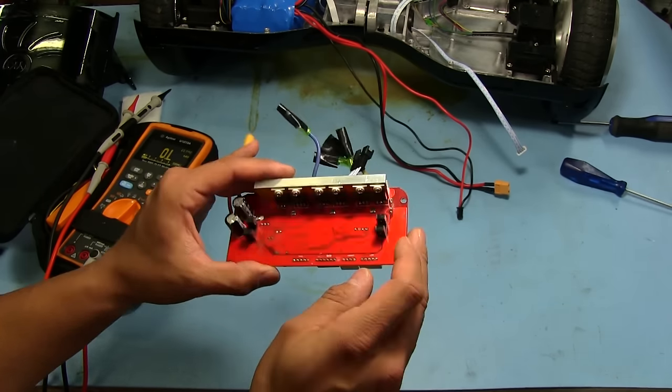So it's reading 0.4. I don't know what they're supposed to be, but if something's wrong, we're probably going to see some major difference between them. That says 0.3 ohms. And that shows 0.3. So maybe there's nothing wrong with the coils, I'm hoping. We can compare it to the other side and see what the other side reads, because there was nothing apparently wrong with the other side. So if both sides are good, we should get about the same readings.